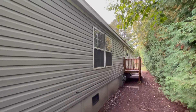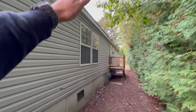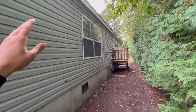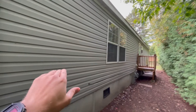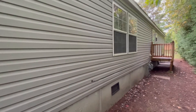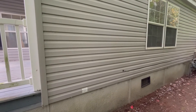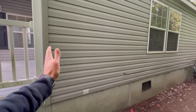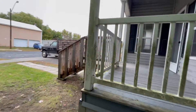Right now is actually a perfect day to pressure wash because there's some overcast. If you were pressure washing in the sun, you want to start washing faster because if the soap dries on there it'll leave streaks. With overcast, this is perfect. So: soap, bottom to top, let it sit for a couple minutes, then wash top to bottom, making sure you spray straight on — never at an angle because that's how you get into cracks. And you do that for the whole house. Find a good distance away, definitely don't go too close. Vinyl is a lot more resistant than wood but you still can damage it. Find a good balance so you're washing everything off nice and clean without getting too close or being too far away.